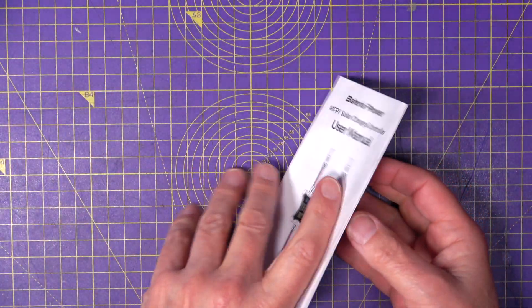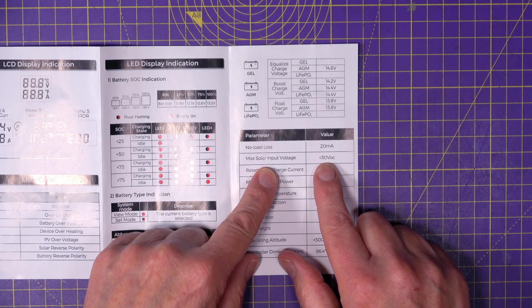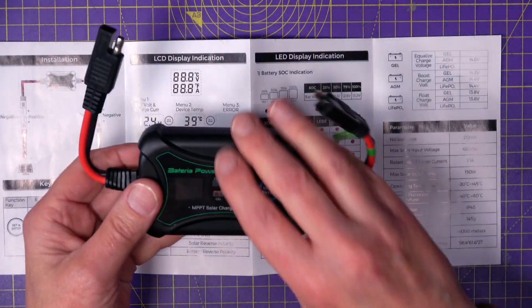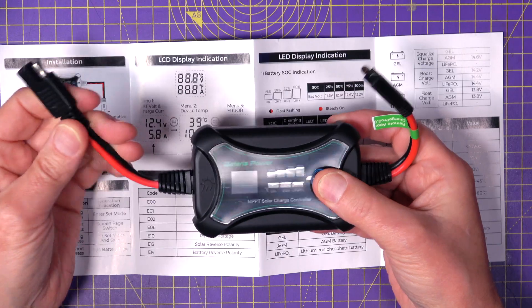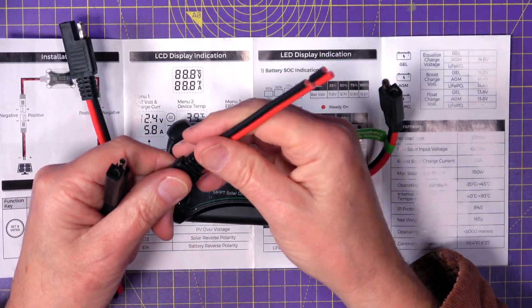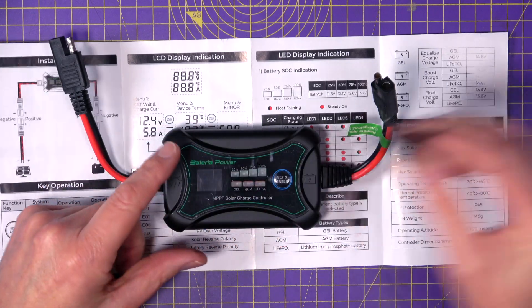In terms of the actual voltages, my solar panel is only a little panel but it's 18 volts, so the maximum solar input on here is 30 volts — fine — and maximum charge current is 10 amps. So it all looks good. There's a little button here which we'll see when we get it powered up, and that just connects to the battery and to the inverter. There are a couple of flying leads included which will need to be soldered up to some longer cables. They also give you a little gender changer connector, which I won't be using, but it's a useful touch.